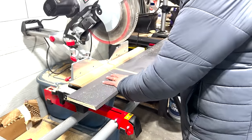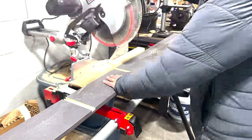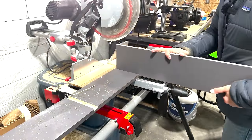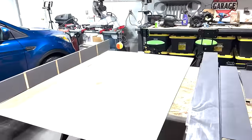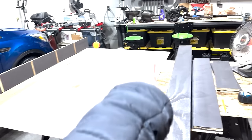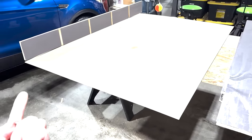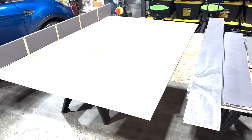Now on to the second side. I have a quarter-inch thick piece of plywood that is exactly four feet by six feet and is square. I'm going to use that to make sure the sides of the smart shelves are perfectly square. I'll use small screws from the bottom and the sides I can reach, slide it over, confirm it's square, and then start building the shelves.